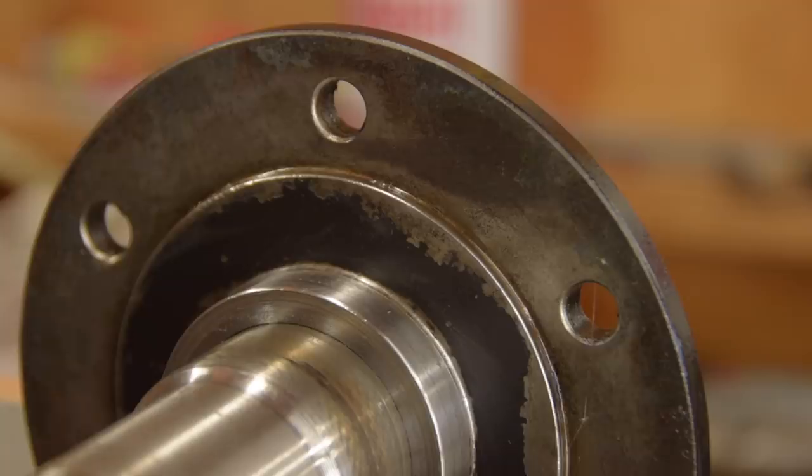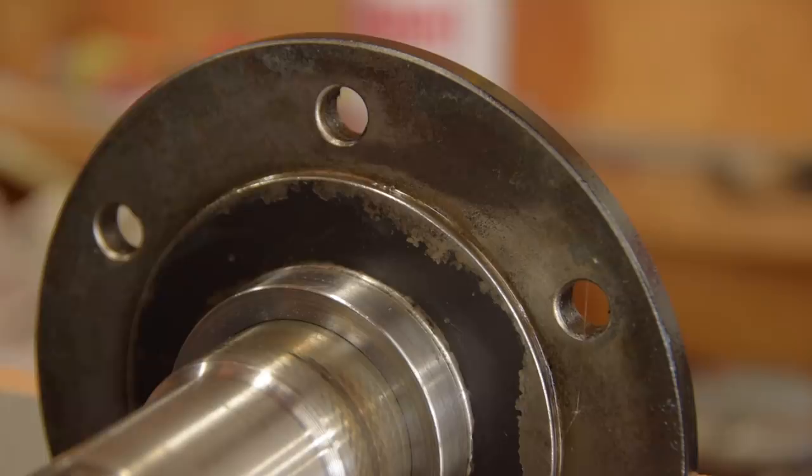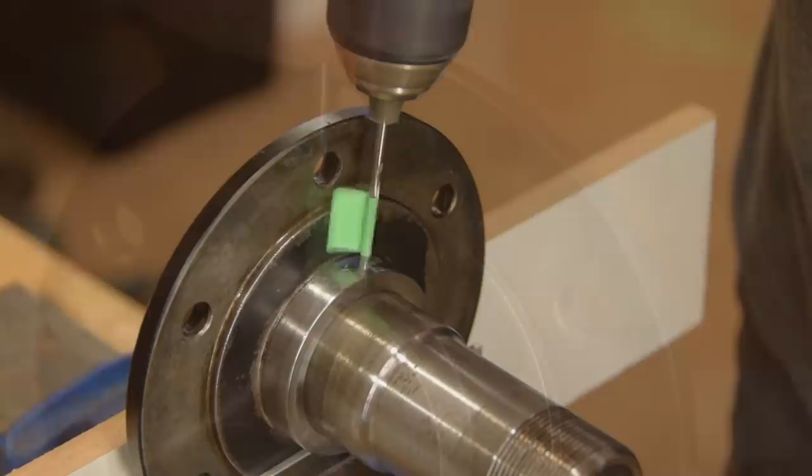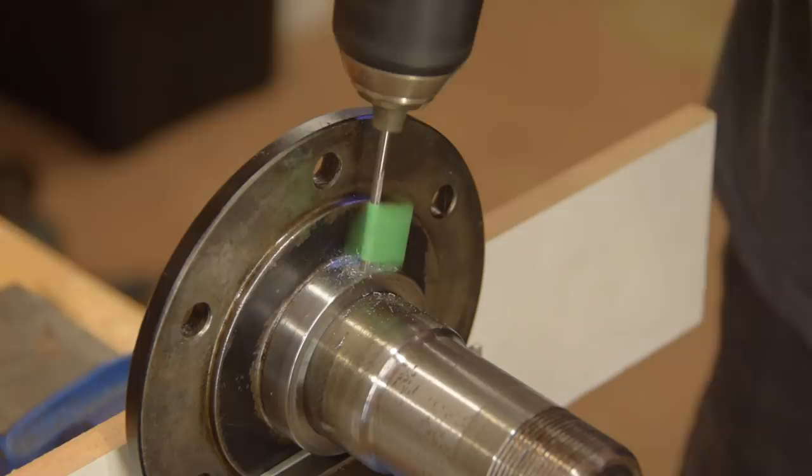The manuals say to split the collar with a chisel. I've never gone straight for a chisel. It's a bit tough but you could skip the drilling and just bash it with a big chisel if that works for you. But I reckon it's a lot easier if you have a couple of holes to make a weak spot. What will happen is that as you drive the chisel in, the collar won't split but it will stretch and come loose.